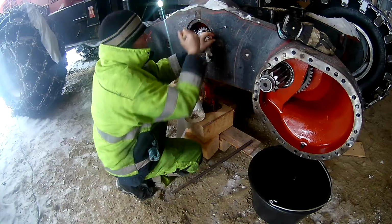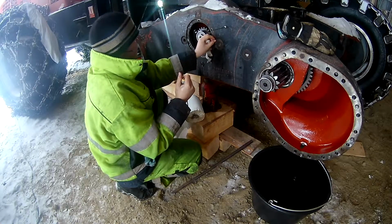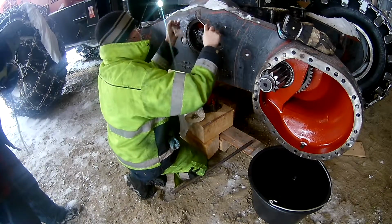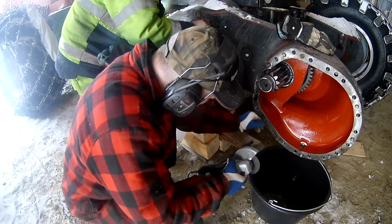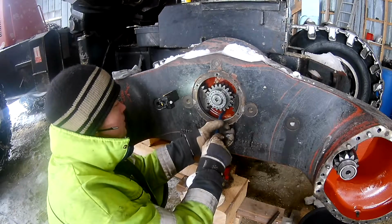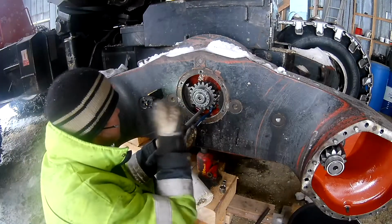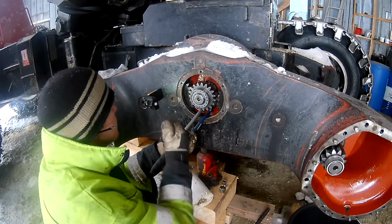There was quite a little bit of silicone or something in the threads, so they were cleaned out. Also removed the old silicone at the lid. There was some mangled metal at a few spots, so that was removed. Also brought out the sprocket so they could be turned individually if it would be required during installation.